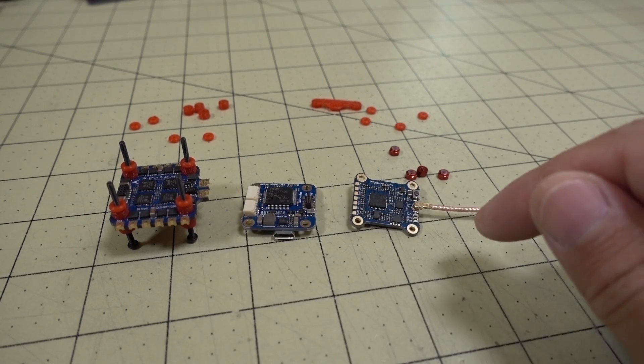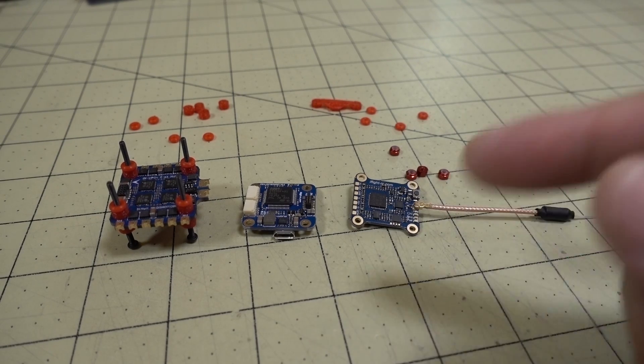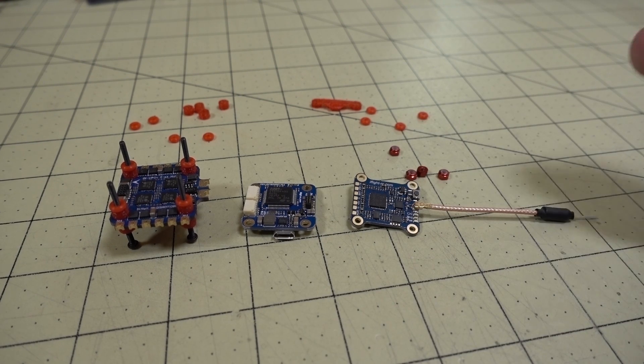The video transmitter is a little bit bigger, but the ESCs are a little bit smaller — though the capacity of the ESCs is also 35 amps, so really no difference between that and the EMAX 6S 32-bit ESCs. Overall, I think this is going to be a good stack for your microbuilds if you're going up to 6S. Most people are probably going to go up to 4S, but maybe something like a 4-inch on 6S. You're probably future-proofed — there are going to be different motors and frames coming out in the future. With 32-bit ESCs and up to 6S, this stack will be ready for whatever comes in the coming months and into 2019. Overall, I would recommend this stack. If you guys want to check it out, there are links in the description below.